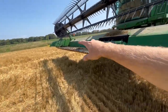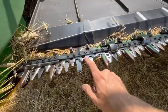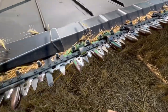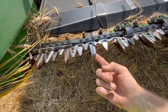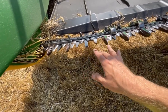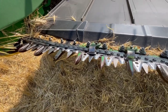I also noticed I'm leaving a strip of wheat right on the edge over here. I see there's a guard broke and the knife is broke too, so we're going to have to fix that. That one's fun because you've got to take this whole bar off. This guard breaks immediately as soon as you put it on, and the previous owner said it did that too. What I'm thinking about doing is taking this one off and putting a worn-out or used guard over here and see if it's worn enough that it doesn't chatter and break off, and then I'll put a new one over here.